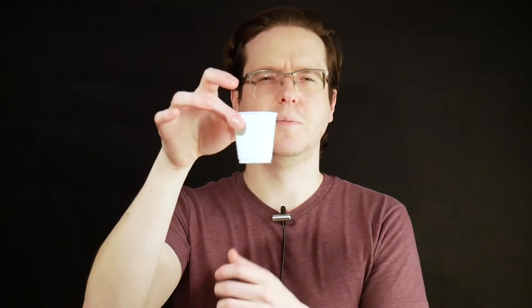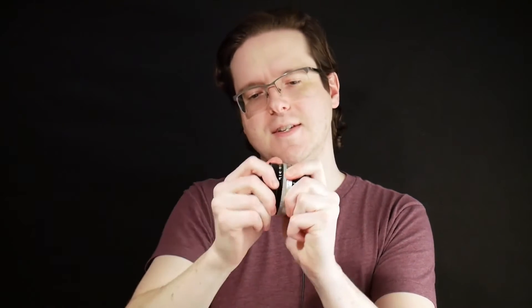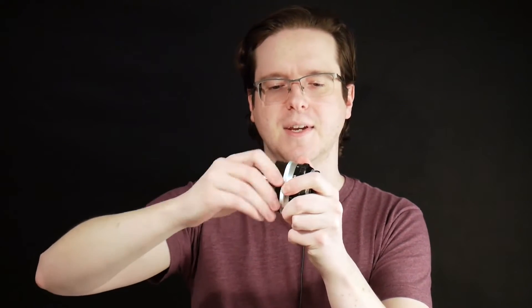I've got the screw out and it's really small — I don't want to lose it, so I'm going to put it in a Dixie cup. If you lose the screw it's going to be tough to use the lens, so be careful. The aperture ring comes off really easily, you just unscrew it. There's a little dry grease in there that I'm going to eventually re-grease. You can hear the little clicks as the aperture ring makes them, and the aperture ring is off.